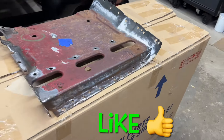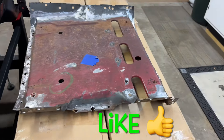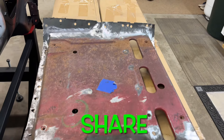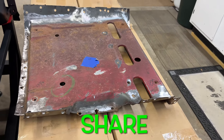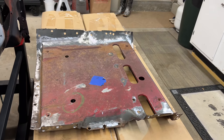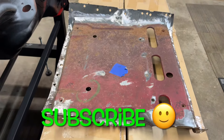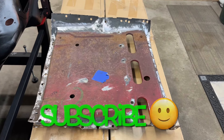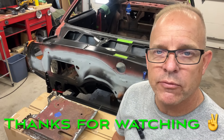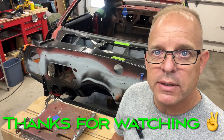But anyways, I'll quit rambling. This is just a quick video. If you've never taken one of these out, these are some spots where the spot welds were on my car. And hopefully if you're having trouble or struggling, maybe a couple of these spots that I didn't know about, you'll be able to grind down or find, and yours will come out a little bit better. All right, so hopefully this helps you. Next we'll get on the rocker, so thanks for coming along and we'll see you on the next one.